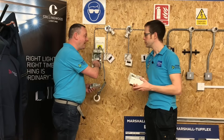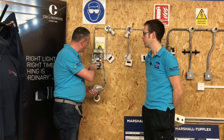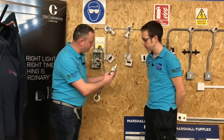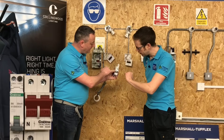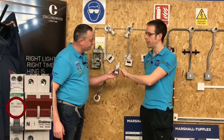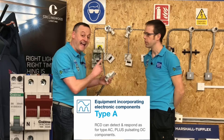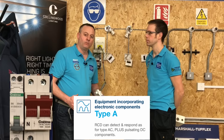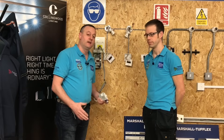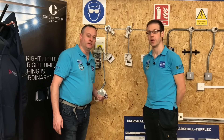In the mocked-up installation here, the RCCB has been swapped over to a miniature RCBO. We've got both a standard RCBO and a miniature RCBO. Through the magic of editing you can see a very different symbol on here, indicating this is an A-type RCBO. Under the 18th edition wiring regulations you've got to match and install the correct RCD protection based on the circuitry and the load that it's supplying — that's a really important point.